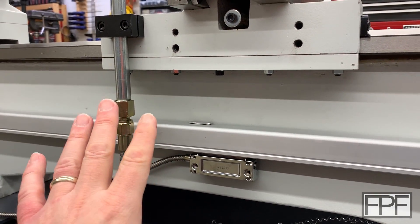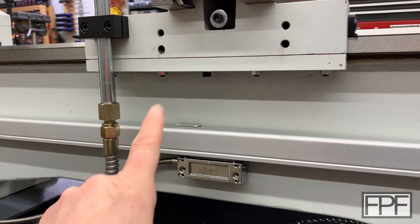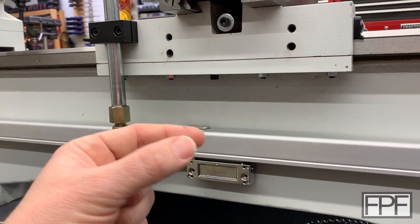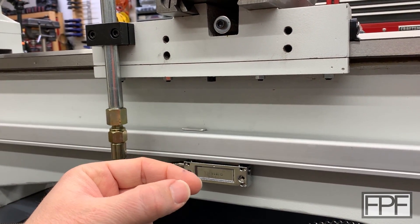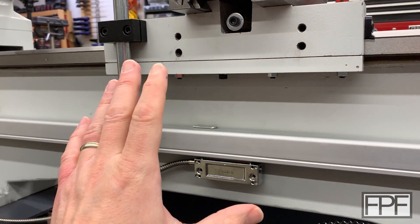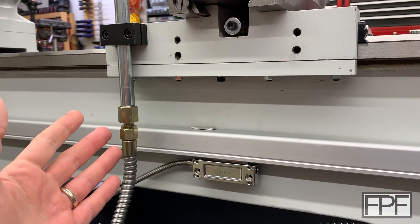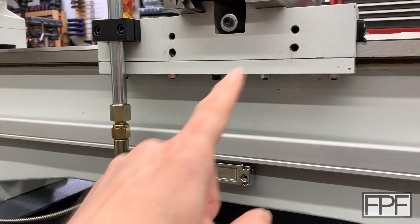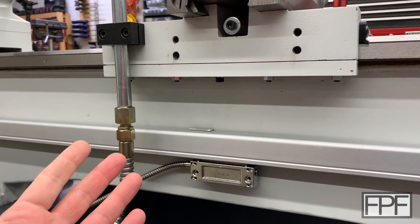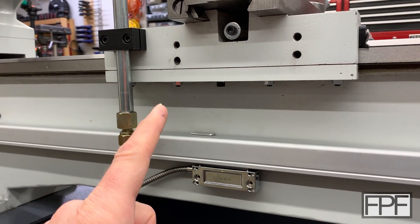I don't think we're ultimately going to be able to use a 3D printed part here, but that's okay — we're still going to prototype this with a 3D printed part. I'm thinking I'll order a quarter-inch solid thick sheet of aluminum, 12 by 12 inches, to ultimately make this piece out of. But I don't want to machine it more than once because that's hours of machining if I want it precise on all the faces. Whereas designing it and 3D printing it is going to take very little time. So let me sketch something up and get it printed out.